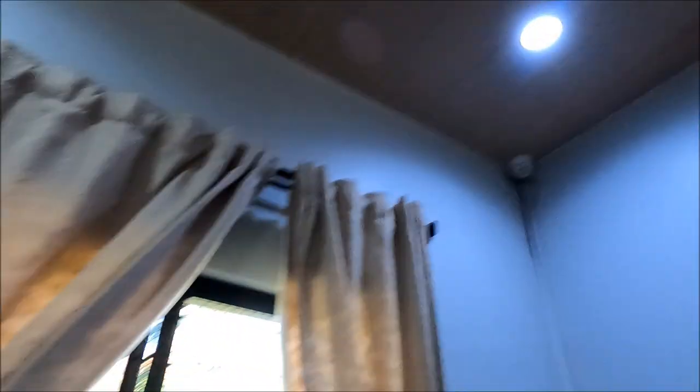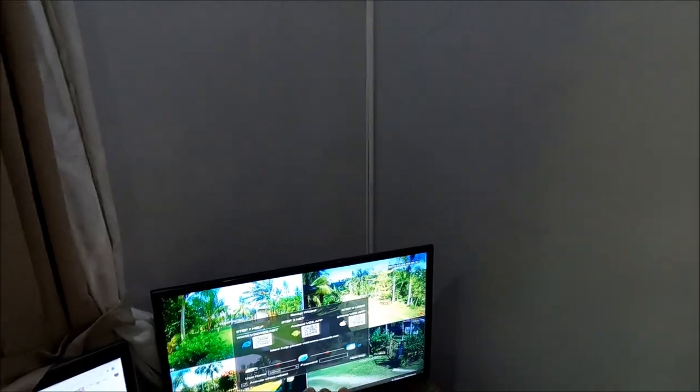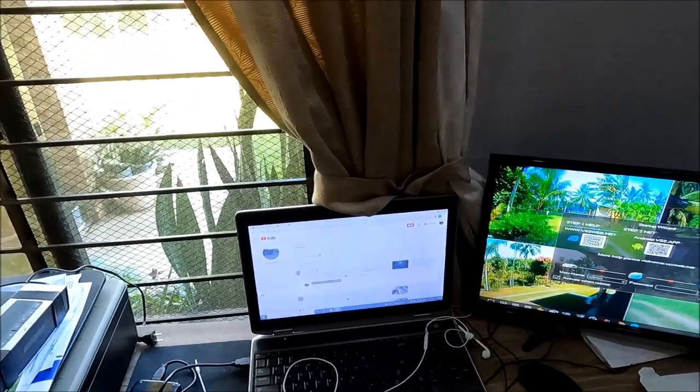I'm running off the 12-volt batteries — two 12-volt batteries connected in parallel, not series, so still 12 volts. I've also run a branch from here to a power point with a black cable that runs the computers, charges phones — whatever I need. That's all fixed and in place; no storm can catch me off guard. Everything is wired in and ready.